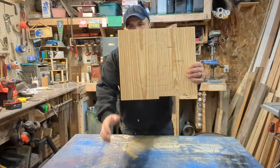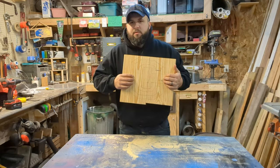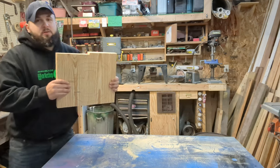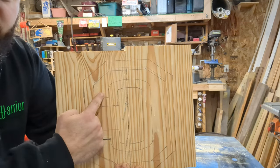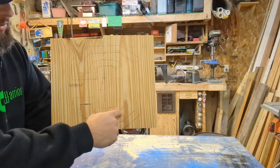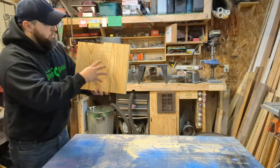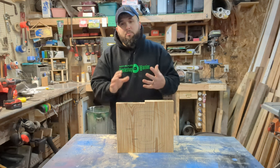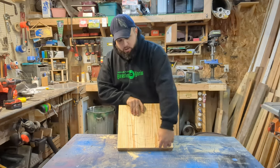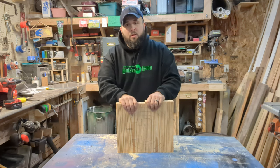I have what I need to cut out. I actually made a stencil on the Cricut because I didn't think I could get the spacing to look right by hand. Because the rails on the sides will be very thin, I'm first going to cut everything out while keeping all the extra material on to hold it together. Then I'll use the router to rout out a back panel groove and a front acrylic groove. Once I attach the back panel, that will reinforce it so I can cut around the letter without it falling apart.